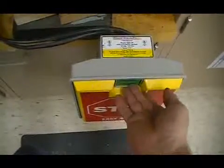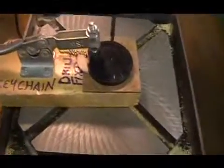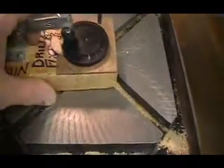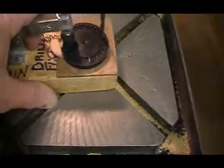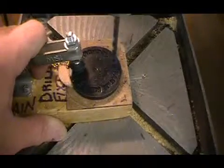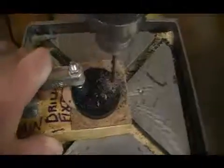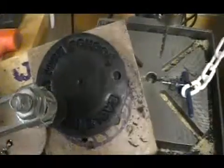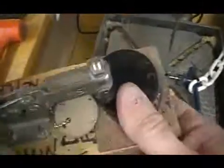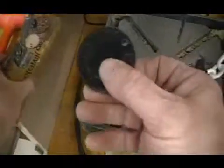Turn the drill press on by pressing the start button. Align the drill bit with the mark on the keychain. Hold on to the handle of the drilling fixture and pull down on the pilot feed wheel handle that will slowly lower the drill bit into the work. When you get to some wood chips, you know you've gone far enough. Good job. Release the pressure on the clamping handle.